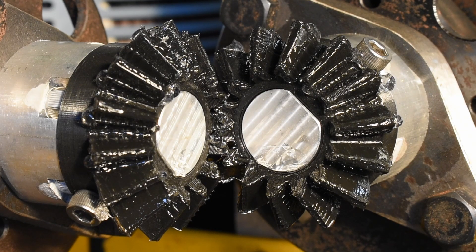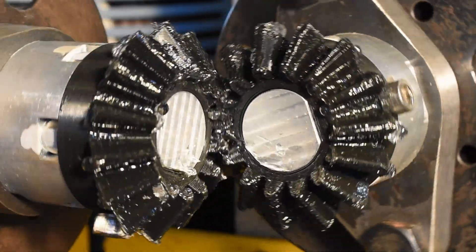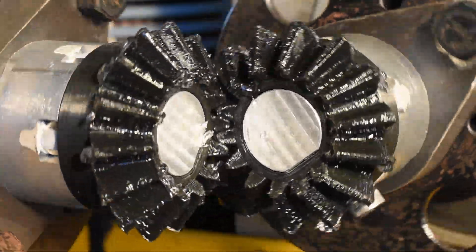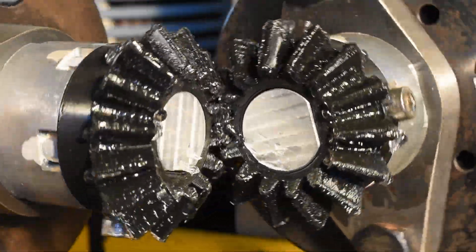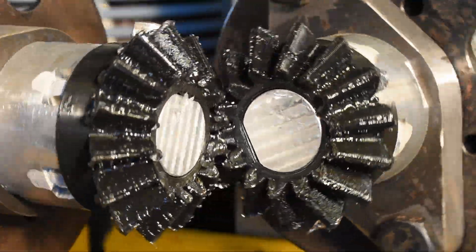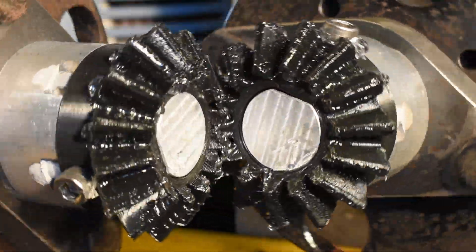The next test is pretty straightforward — it breaks them. It sets the gears to a set speed and begins ramping up to the set max torque at the set ramp rate. When the gears become out of alignment by more than the fail distance, the test ends and the maximum torque is recorded along with the alignment torque and time values so it can be plotted later. The fail distance should technically be quite small, but it's a bit more entertaining to see the gears completely destroyed.